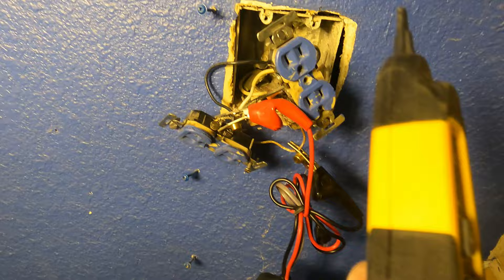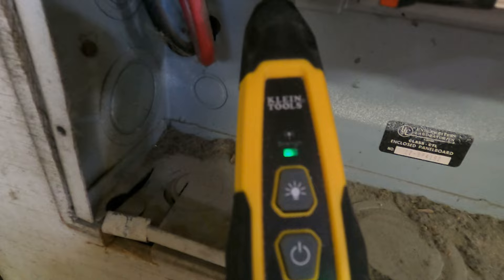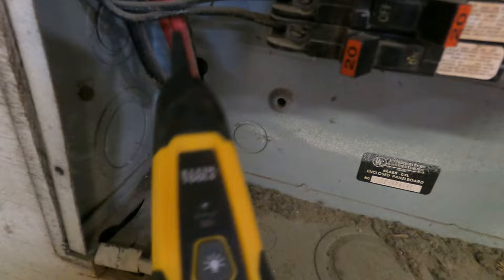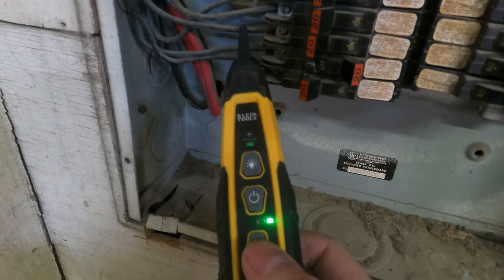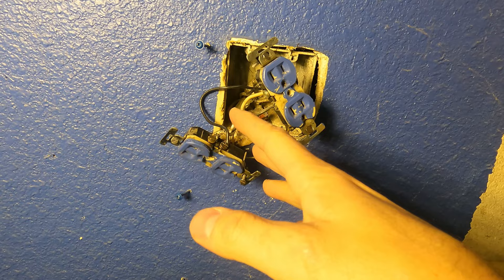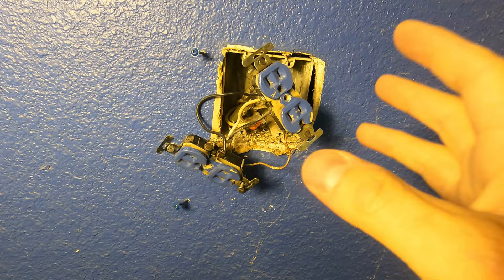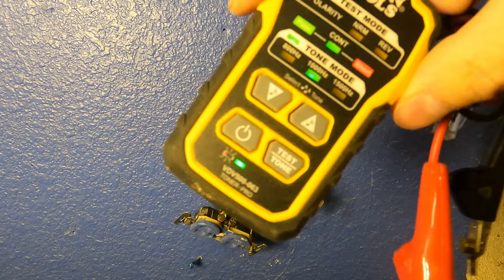We're back on our hot wire — make sure we're dialed in. We can go back to the panel — there's our wire right there. We're on the wire right below it and we're barely getting a signal. No doubt that's our wire — look how close we can get before we see a light. Even the circuit above it, see how the light is just pulsing. Clear as day which circuit we want. You need to try to map out the circuits of the house and figure out what's connected to what receptacle, then start dividing that in half — that'll be in the next video. Let me know what you think in the comments below — thanks for watching!